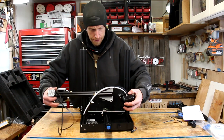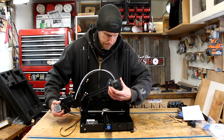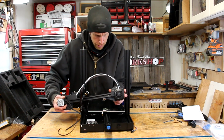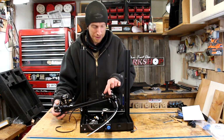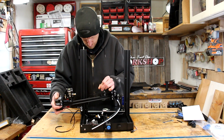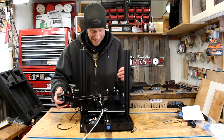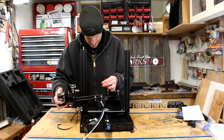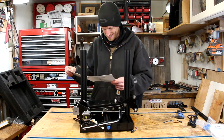And now I believe we can slide our extruder and things in place. You want to do this before you install the bracket. So slide on the extruder, then install the bracket with only 1 screw. There we go. Now we can tighten that back down. Order of operations is important right there. Consult our manual for step 5.